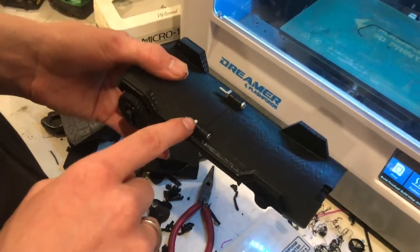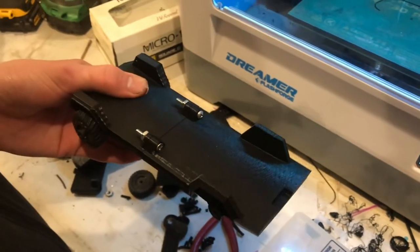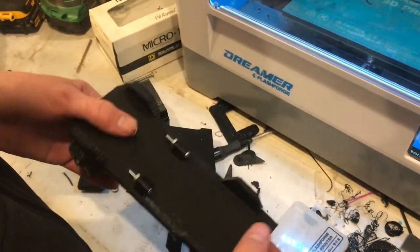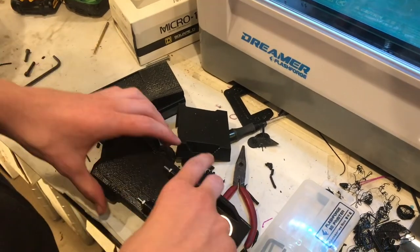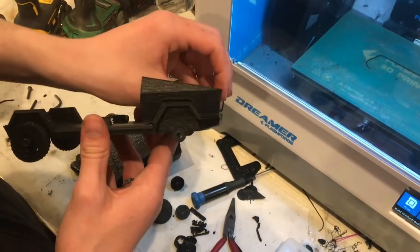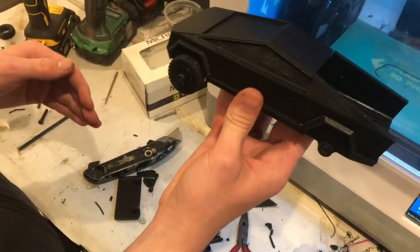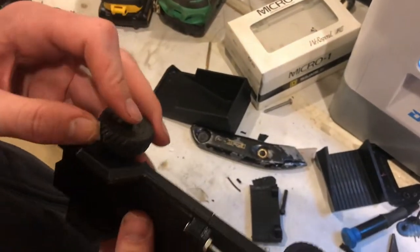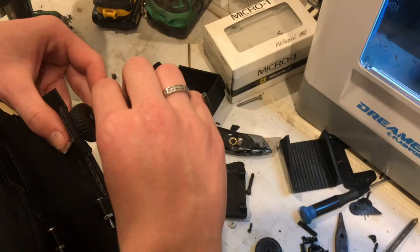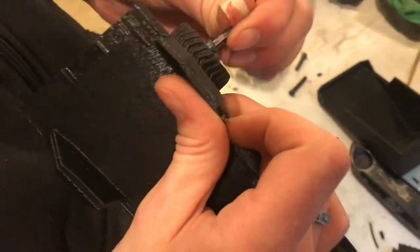This is looking really good. The good thing is they installed screw mounts here, because PLA doesn't glue very well and some other plastics you 3D print with also have a hard time gluing together. Doing it with bolts is a lot easier and it'll be stronger anyway. Here's the back piece that fits in place and the front piece goes right in place. I drilled these holes just a little bit bigger for the correct screw size — they thread themselves into the plastic and it's going in very nicely.